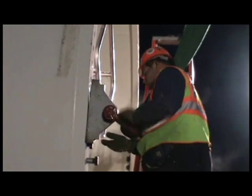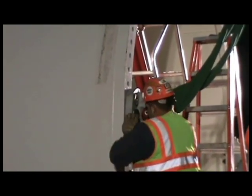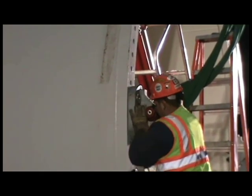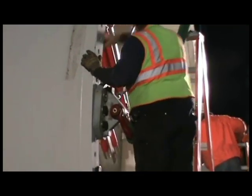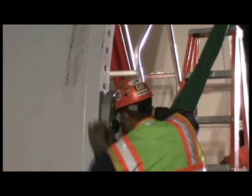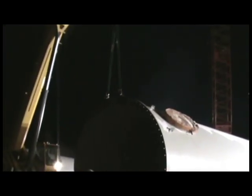The two 32-ton lift brackets weigh approximately 92 pounds each, with eccentric inserts for adjusting hole patterns. The brackets are easily assembled by hand with box wrenches, applying only 500 pounds of torque required for assembly of the bolts. The bolt pattern for the lift brackets uses 6 bolts, giving a 4-to-1 design factor.